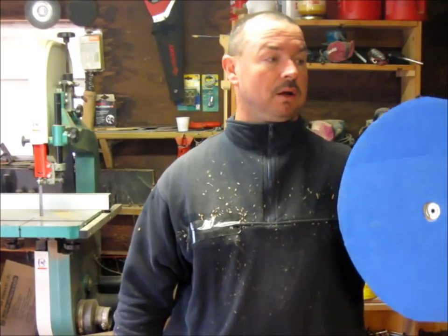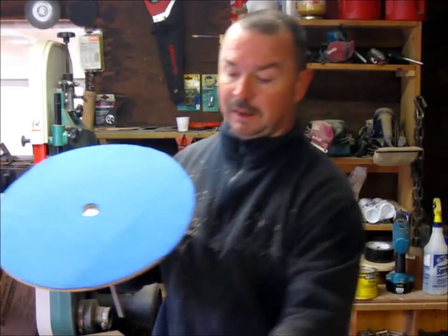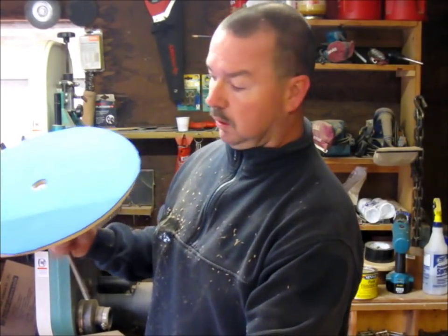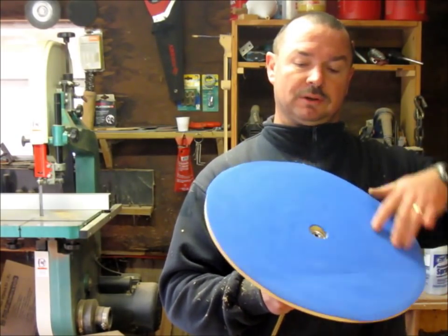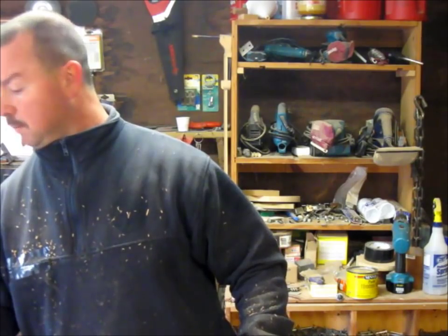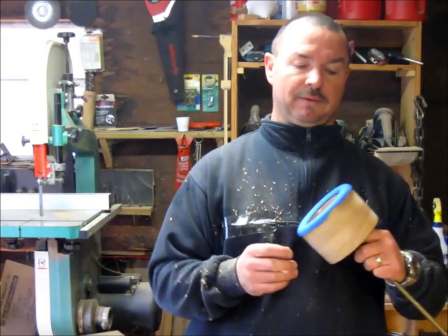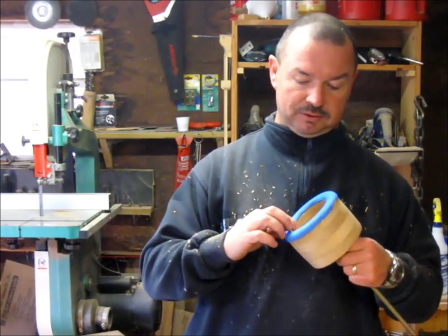There is no tailstock. When you bring this up, there's no tailstock. Of course, I guess you could have one there if you really wanted to, but I've made a couple of different types here, and I could make different types also if I felt I needed it. So, but I've got this one here. This one will do large bowls with a good flat opening on the top, a good true cut on the top. And this one I can get inside a bowl, or whatever. And I can even flip it around and put it back in there if I need to make some type of corrections, fix some bad finish, do some sanding, whatever.